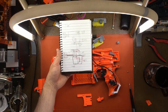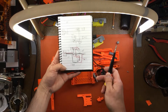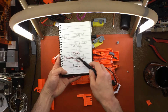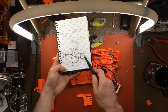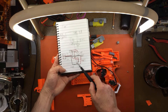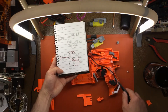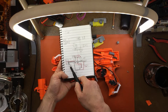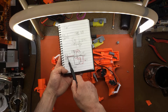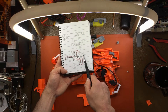What I may end up doing is taking a snapshot of that and blowing it up and putting it on freeze. You'll notice that this is actually the same circuit — it's just in a different configuration. So we'll have the battery here: positive goes to your normally open on your rev switch. Here is the normally closed pin. Normally closed pin is going to go to the negative terminal of the flywheel motors. And then the second line — the negative — is going to go back to the negative terminal of the battery, or XT60. So this is your brake line right here.